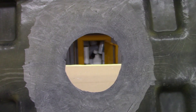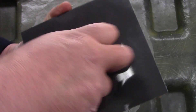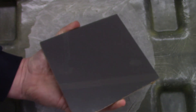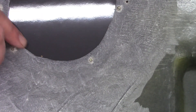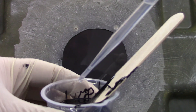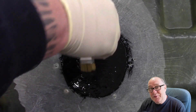In addition to the fibreglass kit for this repair you'll also need gel coat, acetone, a few extra one inch brushes, a small paddle roller, and some sanding discs — we find Abranet grip discs are the best. Firstly we apply a mold release wax to a five millimetre piece of melamine coated MDF sheet. Once buffed, we screw this sheet to the gel coated side of the panel — make sure there's no debris or dust between the board and the panel. When ready, mix up a small amount of gel coat with two to four percent catalyst depending on temperature, apply by brush and leave to cure. It's best to apply a further coat or two to ensure good thickness.